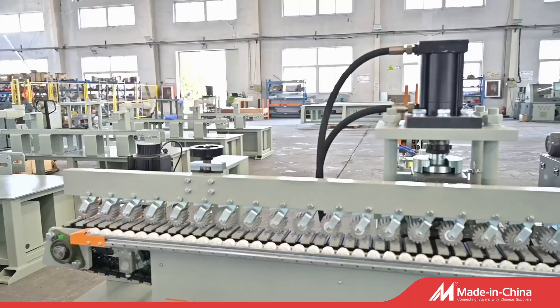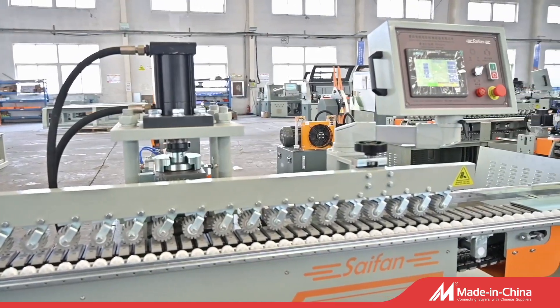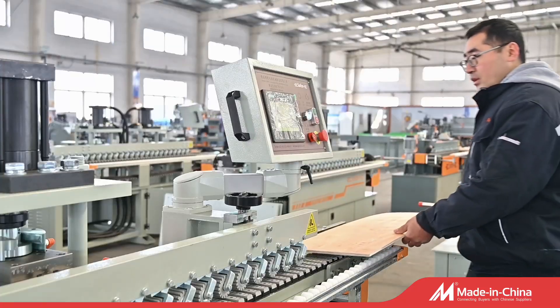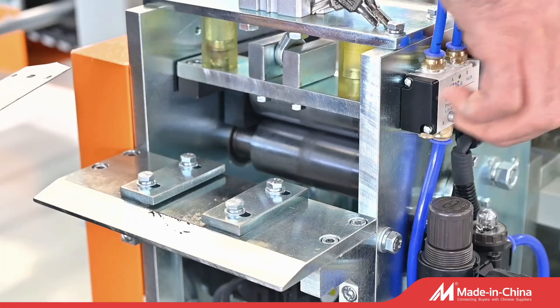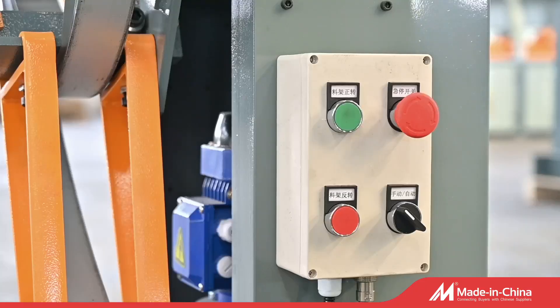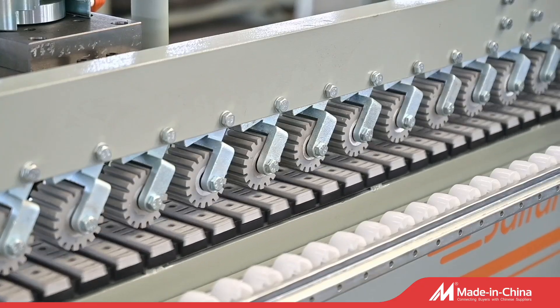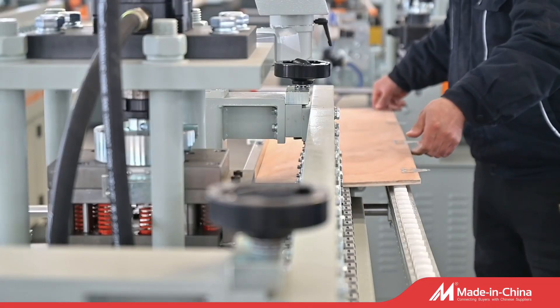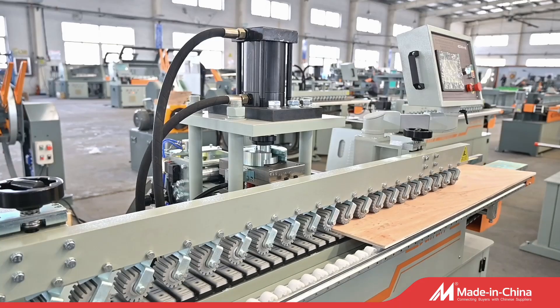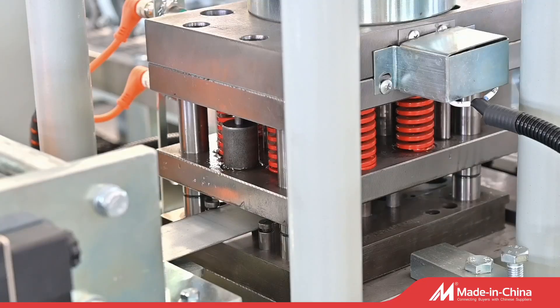SF3203 Professional Single Mode Buckle Machine, used to produce steel buckles pressed into plywood. It is an essential machine for making nail-less plywood blocks. The standard steel size is 50 by 0.7 mm, with a panel feeding speed of about 15 meters per minute, and it can make 32 buckles per minute. It consists of a decoiler and a main machine.